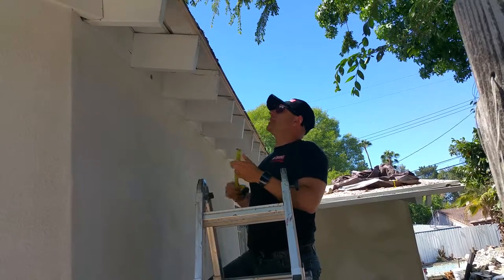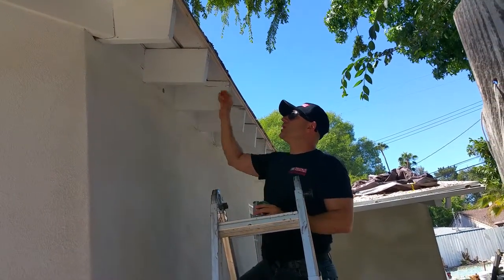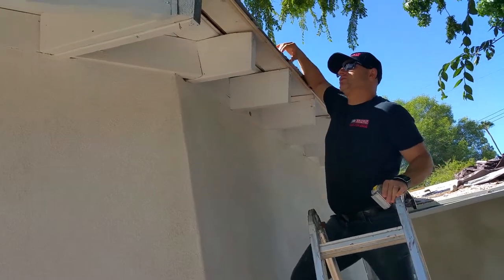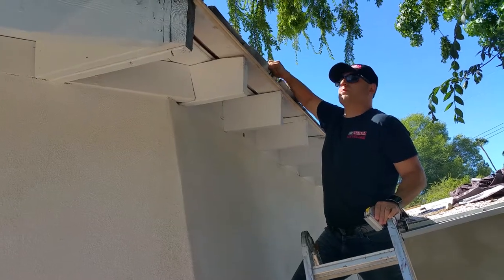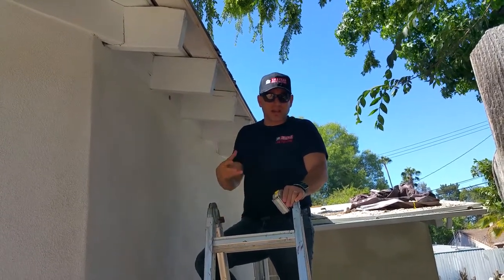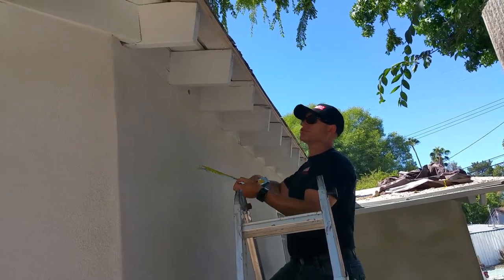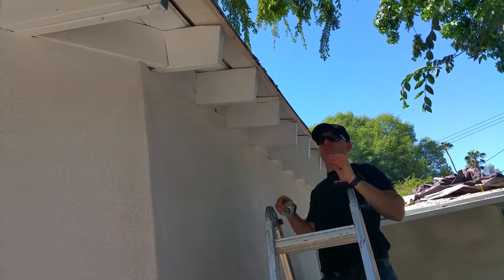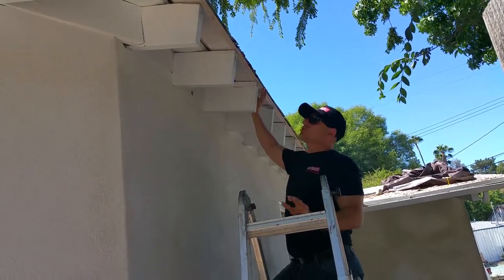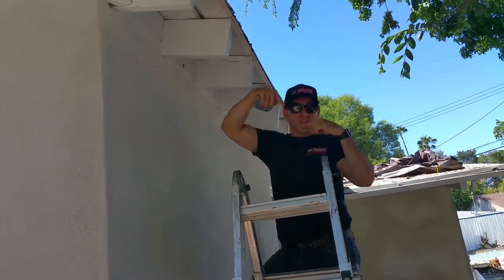As you can see, these are tongue-and-groove eaves. Now if you have any type of rotten wood or dry rot, there is no way really to replace these eaves — you have to go ahead and lift up the roof line. We actually went and lifted the roof line. The only problem is once you peel back the roof, you have to waterproof and insulate the roof again with a membrane, with a water sealant. So at this point we went about 12 inches in — you can see 12 inches, which is a foot — inside the roof line. We peeled the roof back and we changed a couple pieces of eaves, and basically when we change them, we're just plugging them in just like wood floors, because they have the tongue-and-groove portion over here which just plugs in.